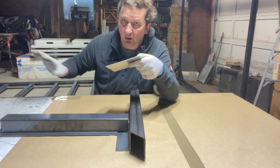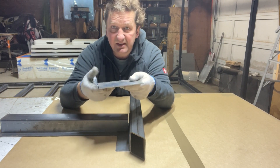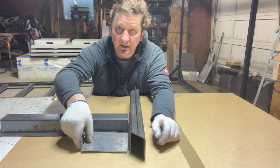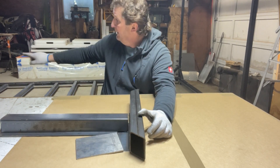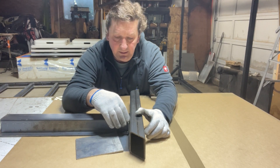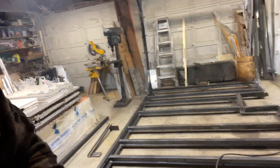When this is all done, I will add from one floor truss to the other a three-millimeter aluminum — pretty stable — which builds the bottom part of the whole habitat. It will be glued into these first. I have to clean up these welding beads a little flat, then glue these plates in and the habitat is completely closed. I welded a small bead all the way around the angle — not to heat the profile up too much — but it is closed so I don't have to silicone it. It's basically fish-tank sealed — no splash water from underneath coming up, no under-pressure sucking water into the insulation. The bottom structure is done.